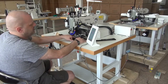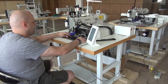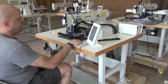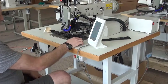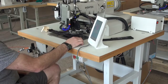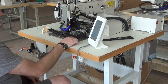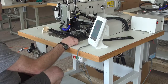When you put the sample in the machine you want to make sure that you have it pushed all the way up against the edge guide on the back side of the sample. On the floor we have two pedals — the pedal on the right-hand side is used to actuate the clamping mechanism. I'm going to push the right pedal once and then a second time — that clamps down both clamps. Then I'll push the pedal on the left-hand side and that will initiate the sewing sequence.